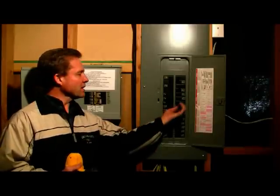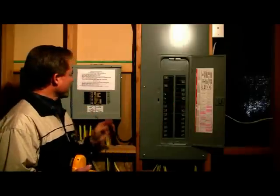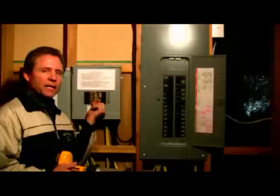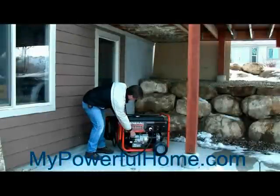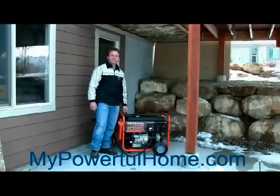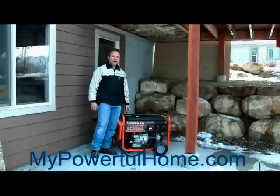I'm going to do the reverse now — I'm going to turn on that utility power and then I'm going to turn off the generator supply. The breaker lock goes up and now we're back on utility power. Because of our portable generator emergency power kit, this customer is safe in the event of a power outage.